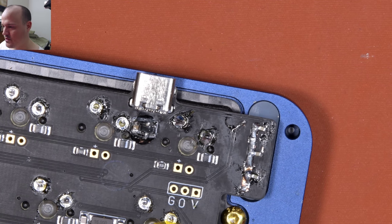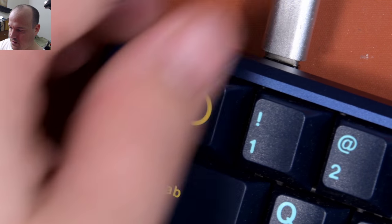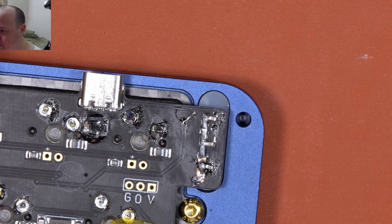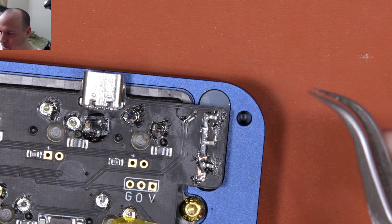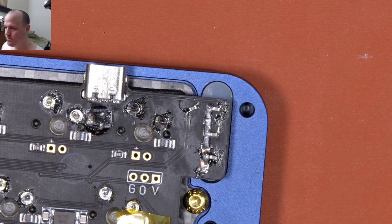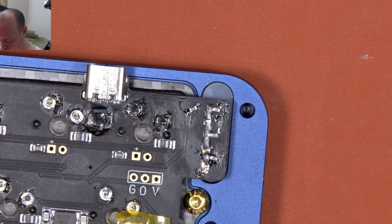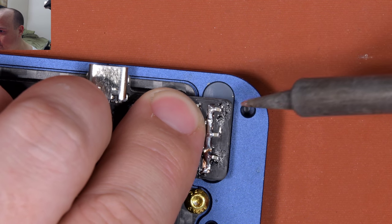Now I'll bring the resistor over. Just to double check that this has had the intended effect, I'll go ahead and plug in the keyboard and confirm I don't see any light coming from the LED. Yeah, the LED is not doing anything because it's not getting the data-in signal — so that means I have in fact broken the connection. The RGB was turned on before and now nothing's happening.